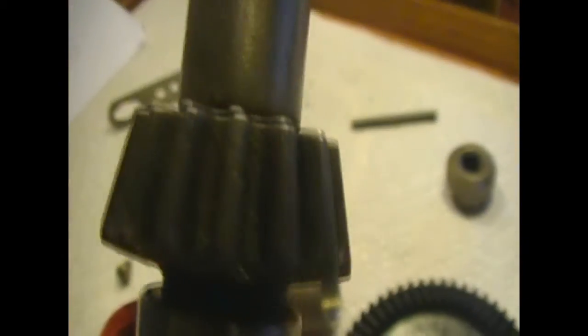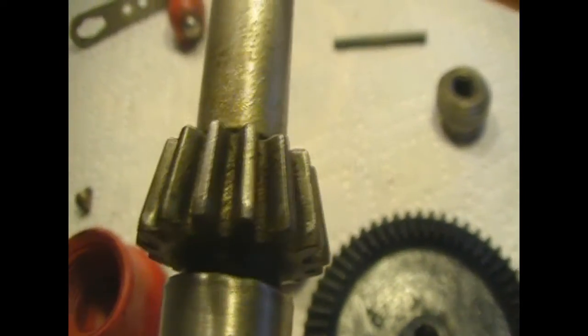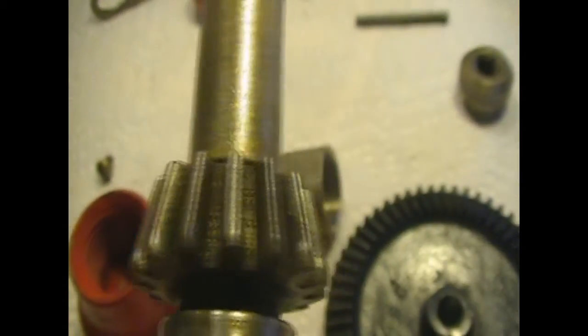Lastly, the two gears on the shaft are made out of low carbon steel bar stock. They are cut to length, closed die forged, and a hole is bored through the center.